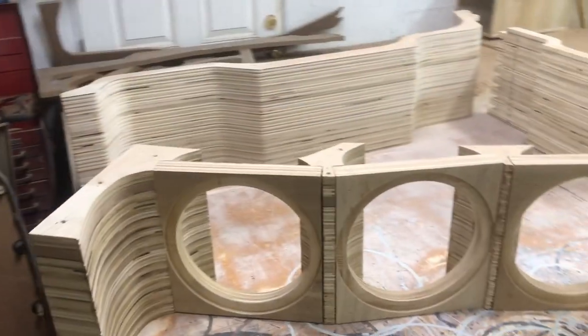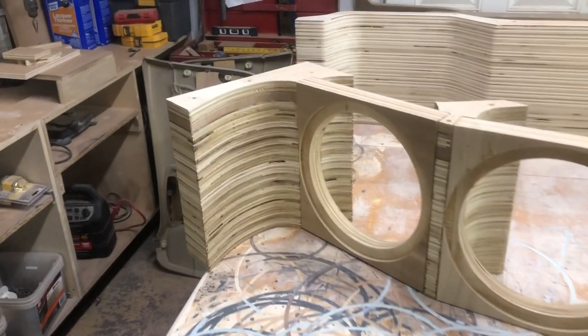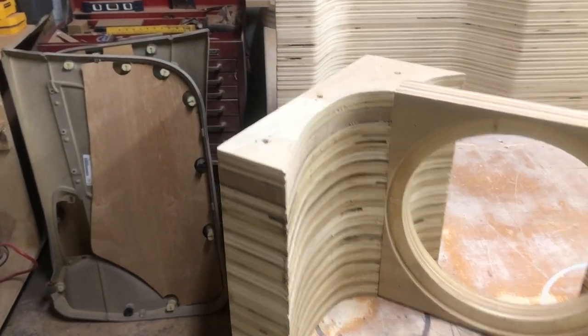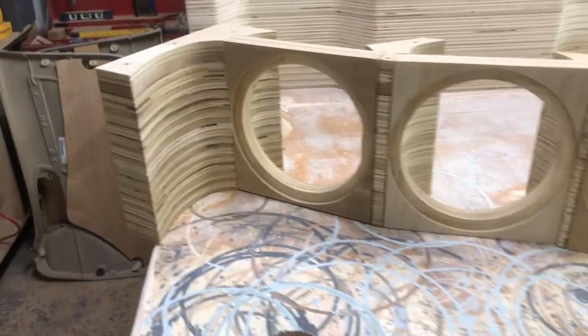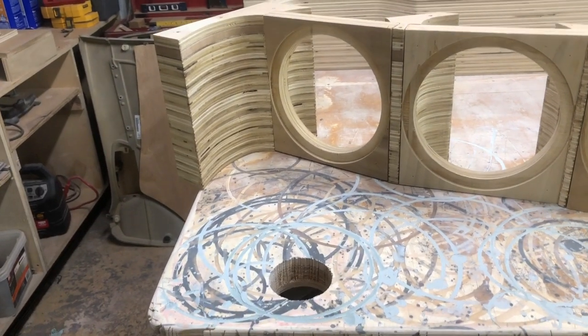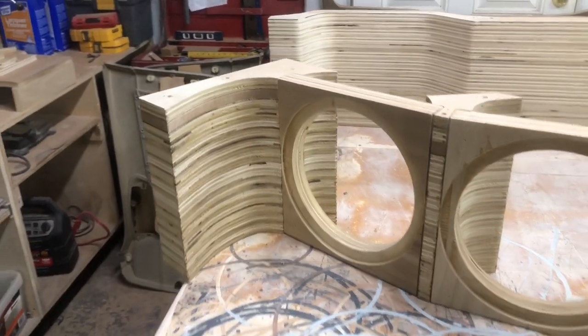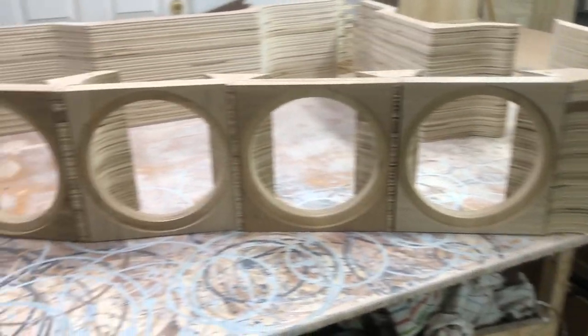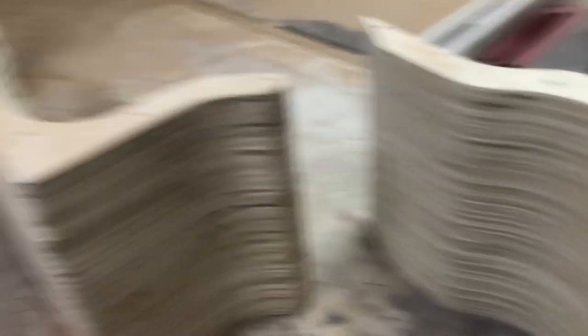Got all the stack fab stuff up here on the bench. I'm going to start taking apart this baffle — as you can see I got some MDF pieces in there. Those were my master template pieces, so those have to come out. Everything right now is not glued at all — it is just screwed and brad nailed. So I'm going to start taking it apart. I'll probably take the main structure apart, sand the individual pillars while they are together, then take it apart and assemble everything.